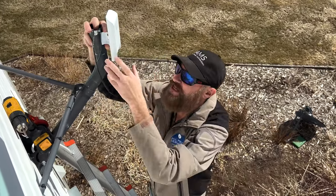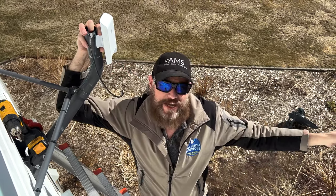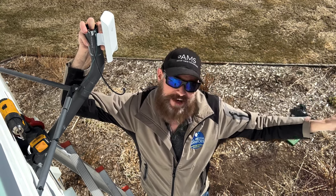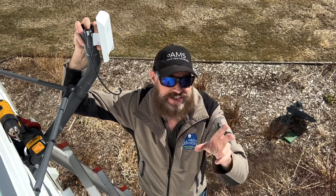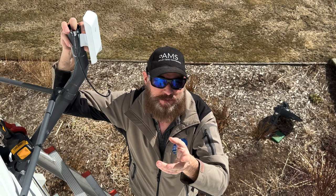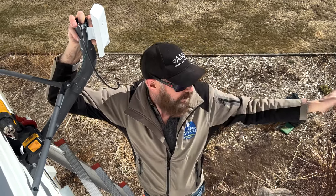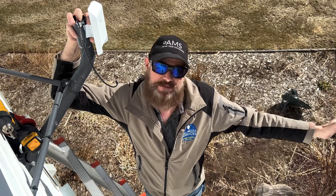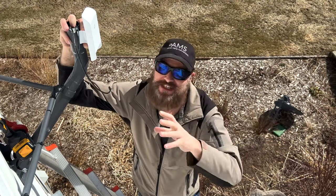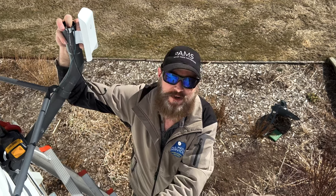On the outside, we've got the dish removed and we're just going to clip our Ubiquiti in here. The challenge of course is we've got some trees, so this is the 2.4GHz — it helps get through obstacles and has further range, and it's better for traveling through stuff. This is not too bad for only having one unit. Ideally it'd be nice to run some N5s point-to-point to get even faster speeds, but compared to what they had before, this is going to work really well. When the leaves come out on the trees there will be some signal degradation, so we'll have to watch closely and potentially upgrade.